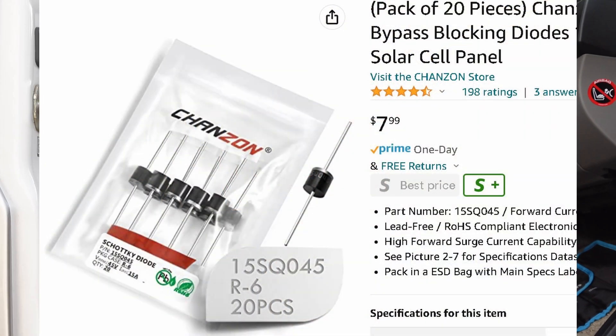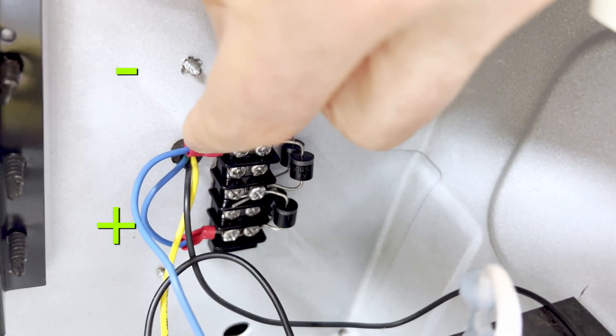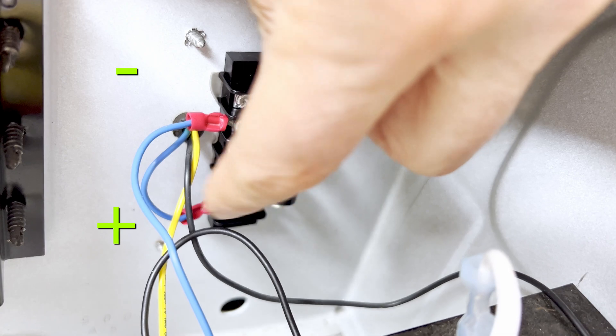After looking into this, do I really need to change this out? I did find a guy who made a mod — he must have been an electrical engineer, which I am not — but anyway, I copied his design. We added some diodes to the trickle start so it changes the cutoff voltage, so my lithium battery will not run down. I decided to add the diodes and not replace it with an ample start, because the trickle start is still working fine. I don't need to buy another device just to do the same thing. All you need to buy is four diodes — I'll put the link in the description — and hook them up like this, and it works fine.